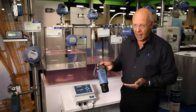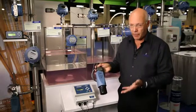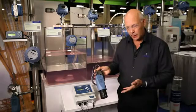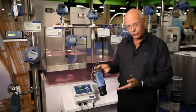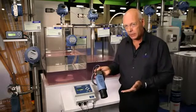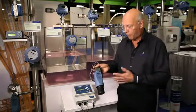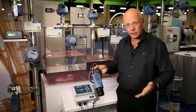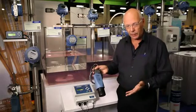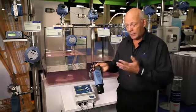Another very useful feature with this product is the powerful diagnostics that are available. In particular, a very useful feature for applications such as pumping station wet wells is the ability to learn and ignore up to four false echoes or targets. Because one of the challenges we have in very confined spaces, when using ultrasonic transmitters, is that signals can be reflected off obstructions such as bracketry, ladders, pumps, etc. in the well. So we need to measure the liquid level and not get hung up on any false targets, and we have this ability to learn and ignore those false targets.